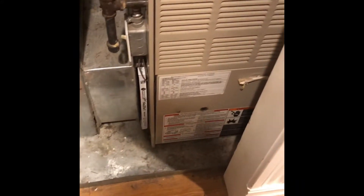Our condensation drain line runs out of the front of the unit and to the floor. We are above finished space. There is a pan that's already built on the floor, so we can reuse that existing pan, but we will have to put a wet switch on the floor somewhere for safety.